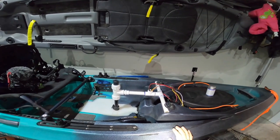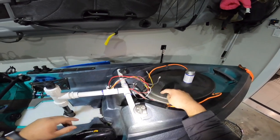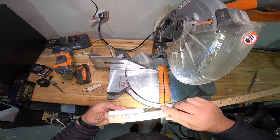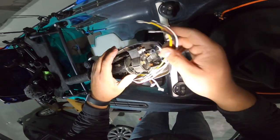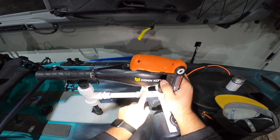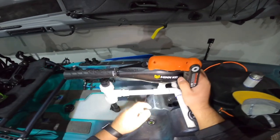That's all she wrote, folks — look at that, there's my trolling motor setup. The last thing is to put a little bit of PVC here, start working those wires up into the head, have the head sit here, and we've got the power cables back here with the battery up front. Measurement on this PVC piece — three and a half inches, went from five and a half to three and a half. Now we can just start plugging in all the cables. Some advice: get your guide holes in the three and a half inch PVC pipe already, because I ran into the issue where I could not get in straight since there wasn't enough room. Get those guide holes in first so you can just punch your screw in and be done.